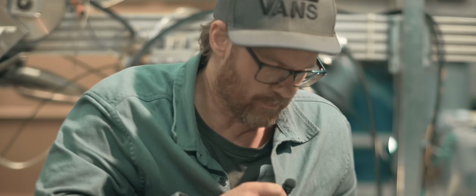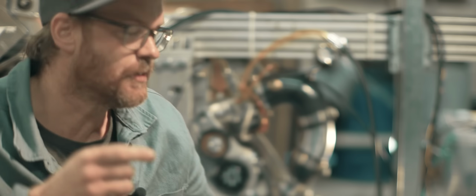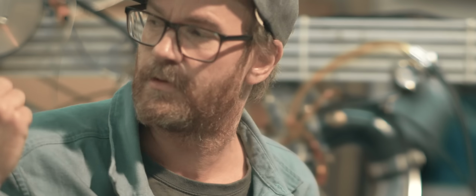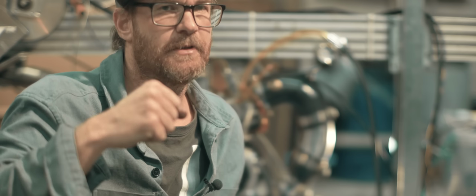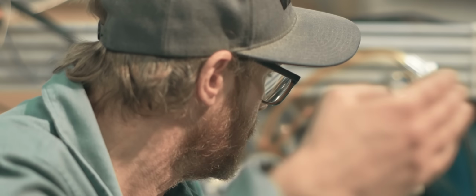Sound is bad, my main camera with the microphone is out of juice. I think I found an issue now, which might help solve this. This was on gas without the retarder connected, and it manages to get past the hump and into where it revs. The reason it's running this well on gas is that my power jet circuits, they're not coming into play before there's more airflow.